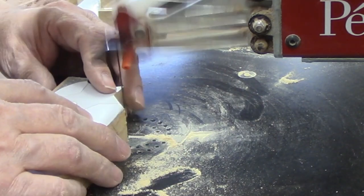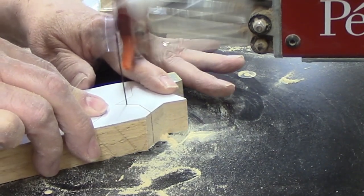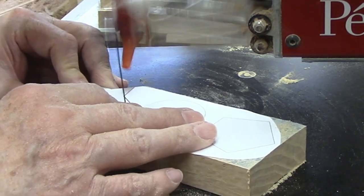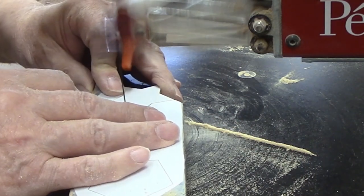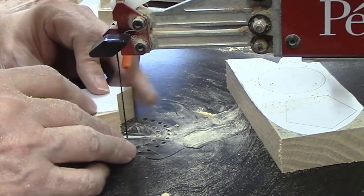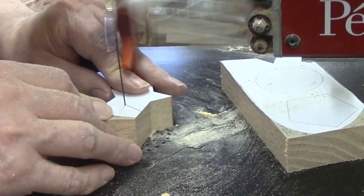With that goof corrected, I continued cutting until I arrived at the next intersection. This was another easy angle, so I made that just by shifting the workpiece. The next section's angle was too far from an edge to be practical to stop, back the blade out, and come back from an edge again. You just have to use your judgment at each intersection to decide which is the fastest, easiest, most efficient way to make the change in direction that will leave a nice, sharp point.